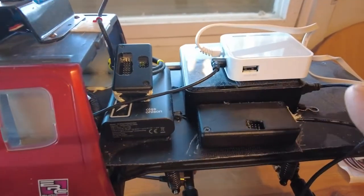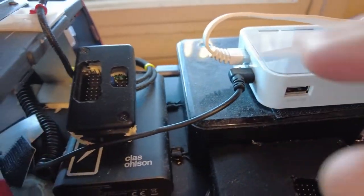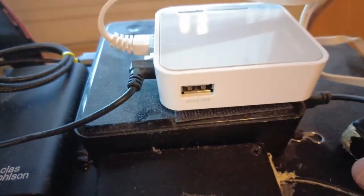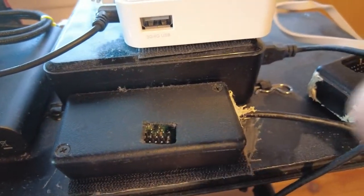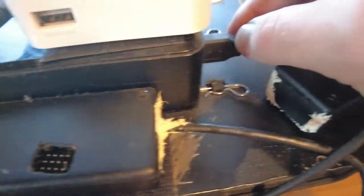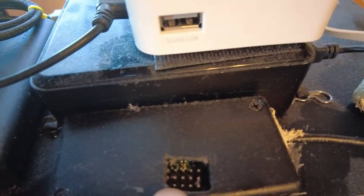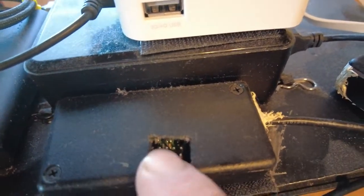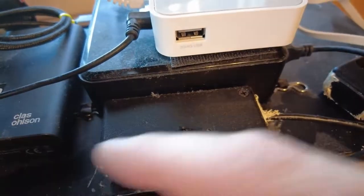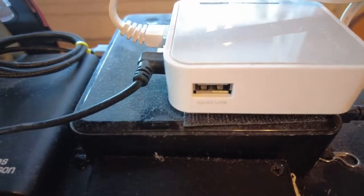Let's go through a bit what I've put here. So here's the computer I put here earlier, the Wi-Fi part, some of the cabling, USB power bank. What else I have here is two boxes from Pololu — the circuit boards themselves. I'll put links in the description. This one is basically a system which you can connect via USB to the computer, and the computer can then control the servos and everything else connected to it — effectively the same as the receiver, sending signals to the different servos like this one for the camera, the steering and so on. But this one's source is the computer via USB.